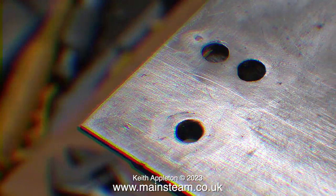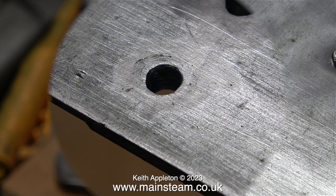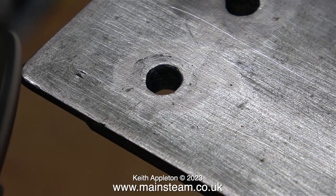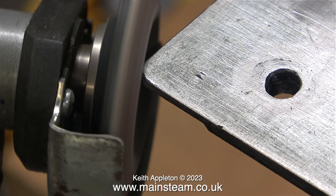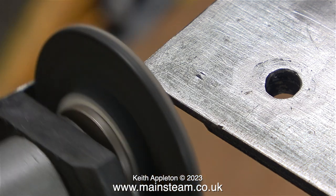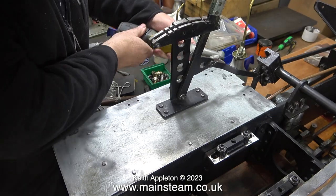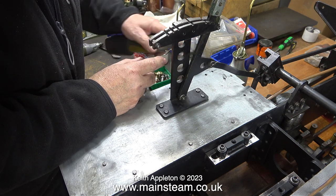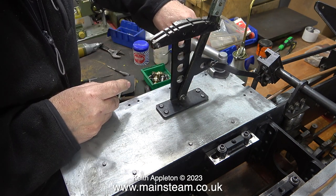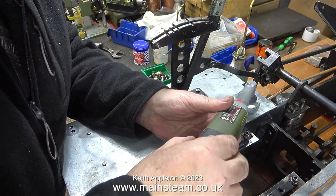Now I'm going to tackle this particularly vicious piece of steel plate that keeps scratching my hands and fingers. All of the edges of these two pieces of steel plate that form the cab floor are sharp and rough. I'm using my small Proxon angle grinder fitted with a flapper wheel to dress these pieces of steel plate and make them no longer sharp. After going around all the external corners and edges, the steel plate feels far better. I'm also deburring every one of the holes, because there were burrs on just about every one of them.